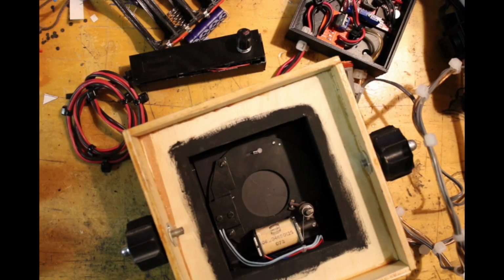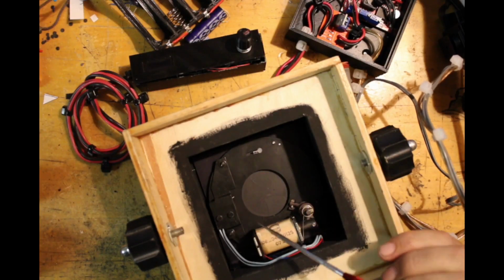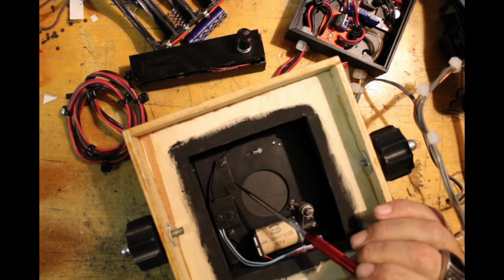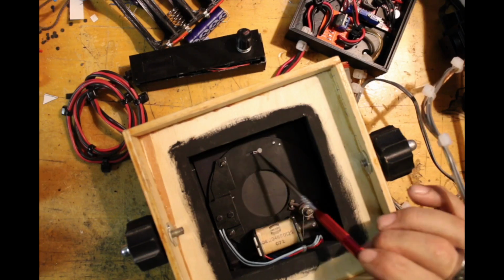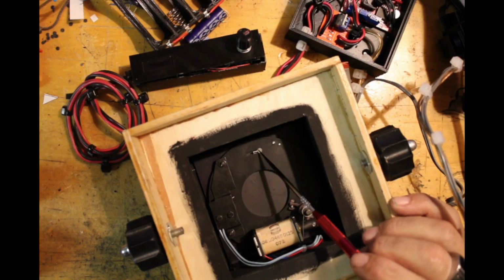Because really the hardest part with a shutter like this isn't the electronics. It's not the solenoid. It's not the micro switch. I mean, these micro switches, you can get them all over the place, especially with the popularity of 3D printing and with the resurgence of the DIY build your own. You know, it's a similar tactile switch to what you get for your end stops on a 3D printer. So micro switches like this are all over the place, but getting the shutter blades manufactured and the internal mechanism, which isn't complicated, it's a fairly simple system.